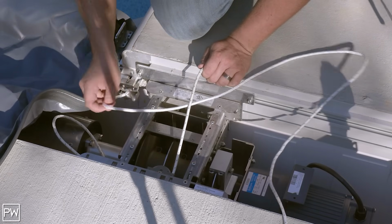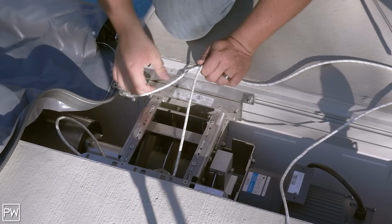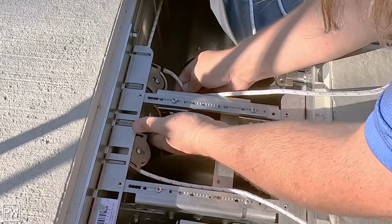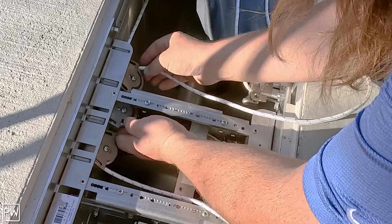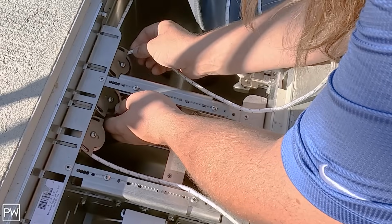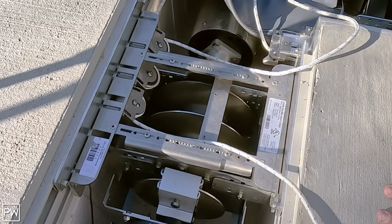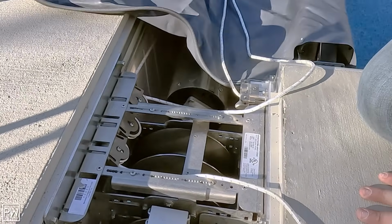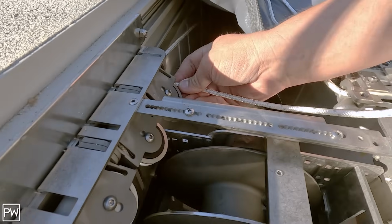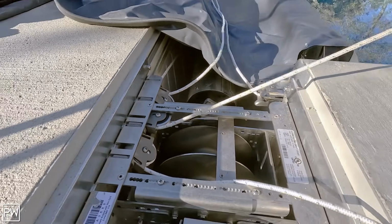So that far side rope goes all the way through the back to this side of the rope reel. Our close side rope, this one, ultimately is gonna go through this pulley, and be on the close side, close to the pool. Our next rope's gonna come through here. This one's generally a little harder. I like to crook this one a little. Okay, we're through our first pulley here. Coming around to our second. I can see it in the pulley window. So I'm gonna take a small flathead screwdriver, which I don't remember where it went. Take our small flathead, you can use a little hook tool. Just kind of encourage that rope right there. We're good to go. I'm gonna pull all that through.